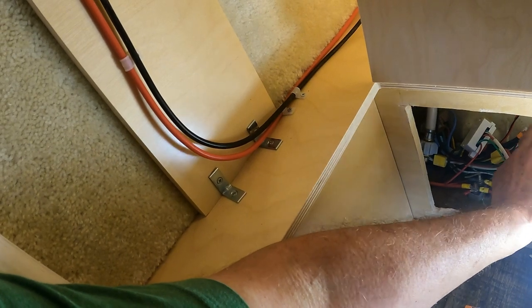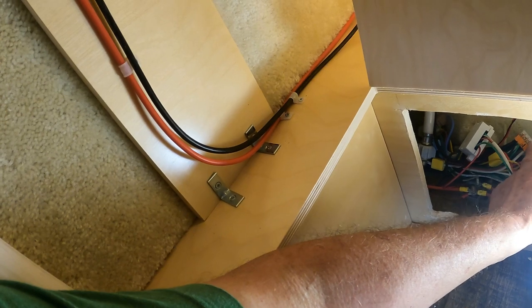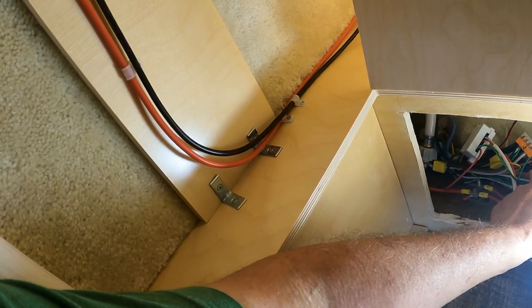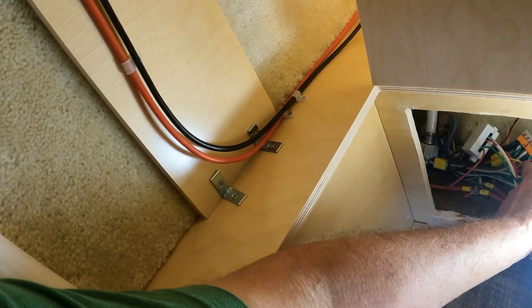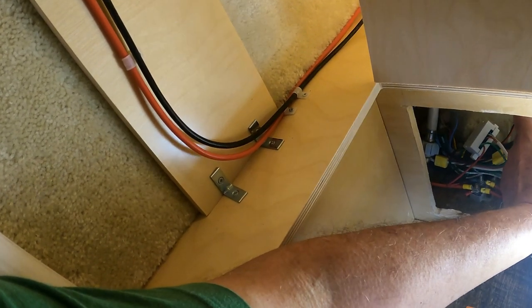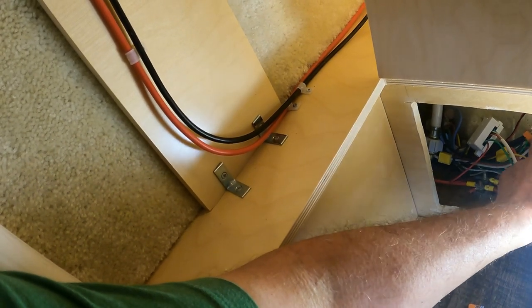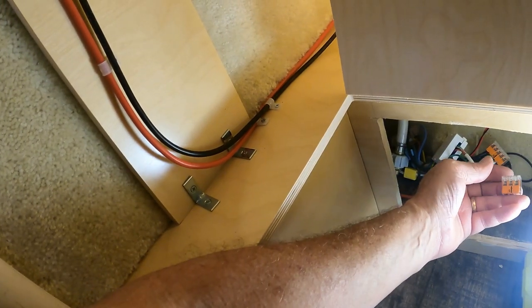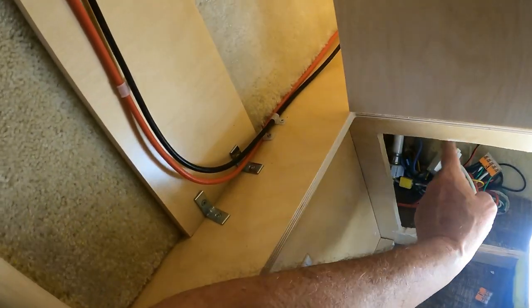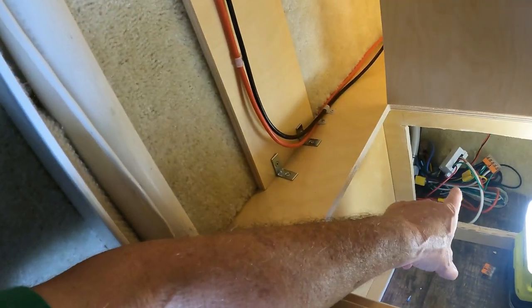And then I've got the two big ground wires in the Casita. They're hooked up to this. And then my wire for my lights is the ground for the lights. It's a negative side of the lights. So what I bought is a 5-unit WAGO instead of a 3-unit WAGO. And I basically just swapped it out and added the silicone wire to that,